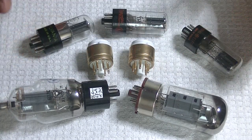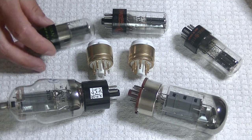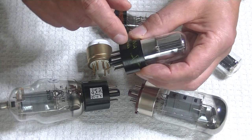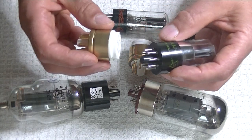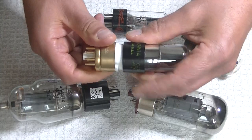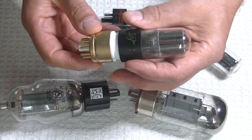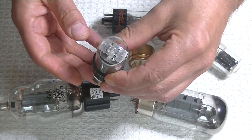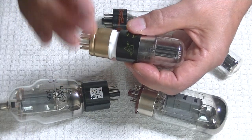In a minute we'll talk about how to fix that glue bond if you've got some loose bases. But let's look at socket savers first, because this is really a solution. With these old style deep bases — and a lot of vintage tubes have them, a lot of the octals — socket savers are wonderful. Load your vintage tubes outside of the amp and then put the whole assembly in, just like that. Sometimes when you pull them out you'll get the whole thing out because these are fairly tight, and you want tight.